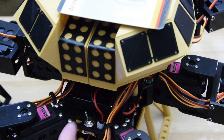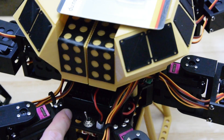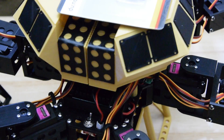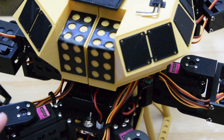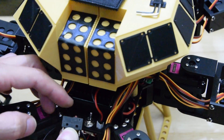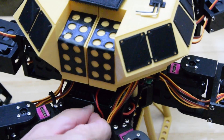What I've added here is a master arm switch for the blaster, so that when I first boot the thing up, or if I just want to walk around without having the possibility of it firing, I've got a master arm switch so I can just disarm it — make it benign, for lack of a better word. What I'm going to do with the rest of this loom is cut it up and run it through this relay board. I'm going to use the digital pin from the Arduino to trigger this relay, which is basically going to do the job that this micro switch originally did in the blaster — so it's basically pulling the trigger. I've got that programmed to my PS2 remote control so that when I pull the trigger, it'll pull the trigger. I've got that master arm switch there as well, just as a safety.